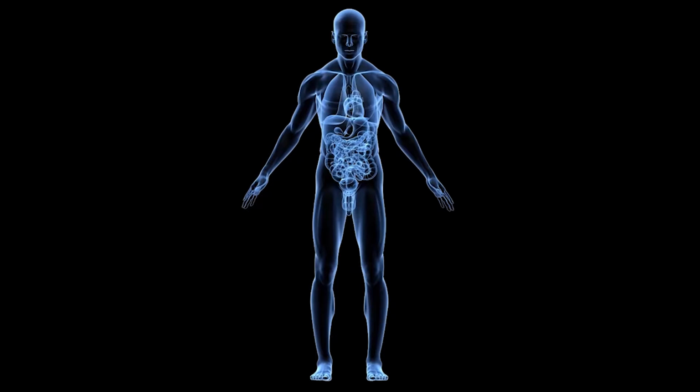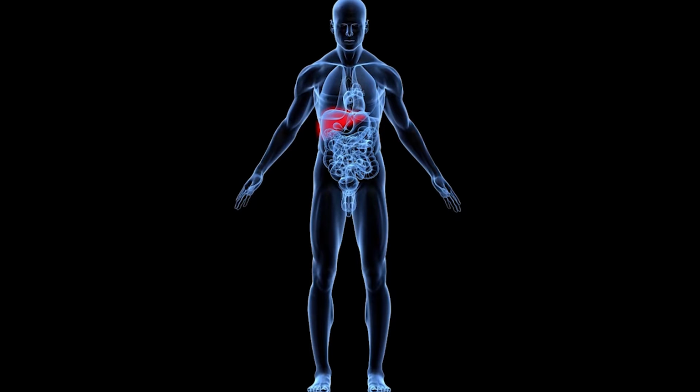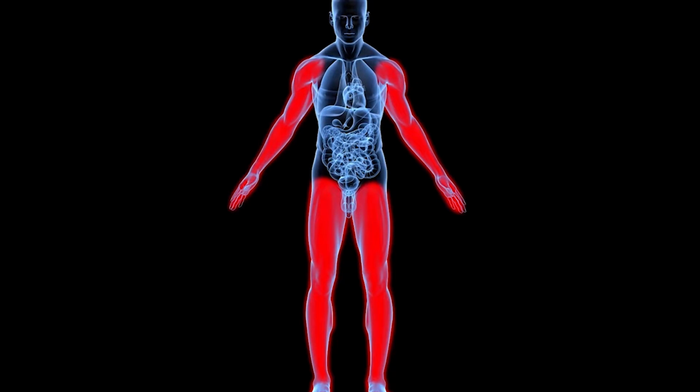The maximum arrest force is listed as 900 pounds force, which simply means that as long as you use the equipment properly, the energy absorber will keep the arrest forces felt by you to no more than 900 pounds force as your fall is stopped. The maximum force the human body can endure without injury is 1800 pounds force. Arrest forces exceeding this limit can lead to serious injuries, including ruptured intestines, fractured liver, organ displacement into the chest cavity, and/or fractures and tears to your extremities. All very nasty stuff.